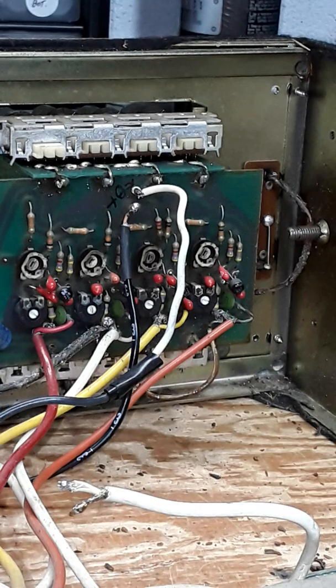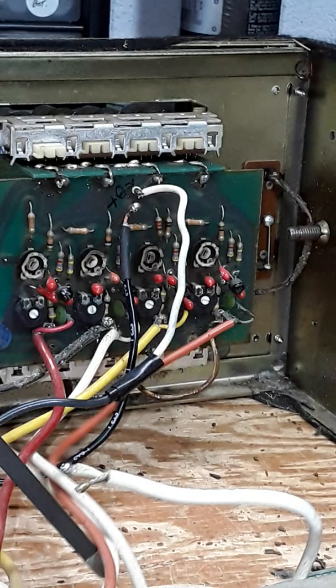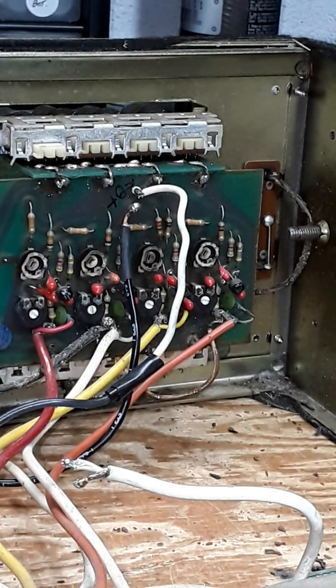Now, previously I had talked about repairs that I've done on these units and the type of wire that I would use. And it's colored as well. But the difference with the wire that I tend to use is that the center conductor insulation will always be white. I try to match the original Binson colors when I do it, just because this orange wire, by the way, or salmon color, whatever it is, in Binsons that'll either be salmon or blue. I don't have any salmon color, so I'll use the blue stuff.